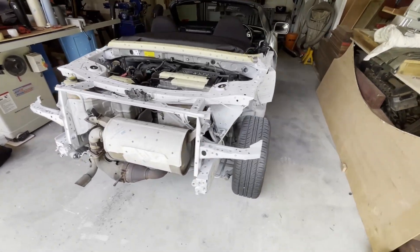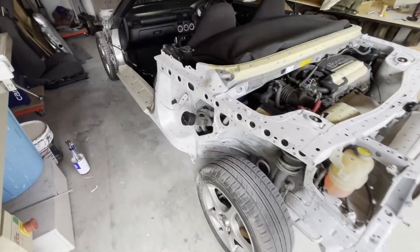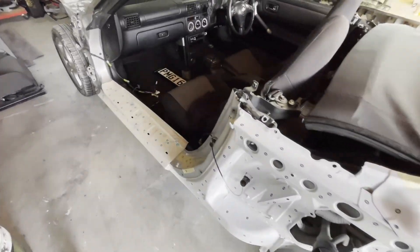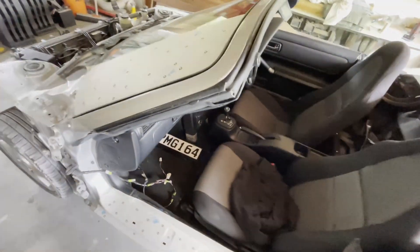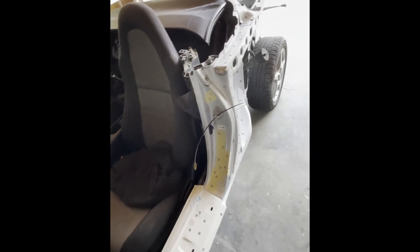You can see I've absolutely covered the entire chassis with these marker dots, roughly 100 millimetres apart. The 3D scanner needs to see at least three points within the scanning area — this allows it to keep track of where it is and helps with the alignment.